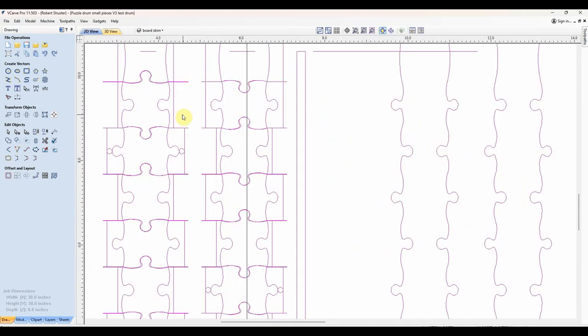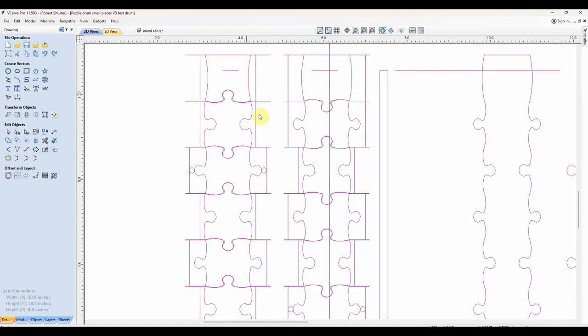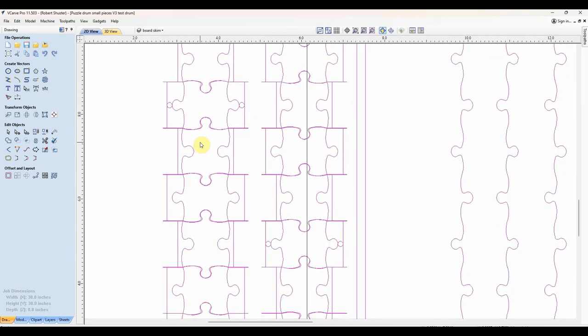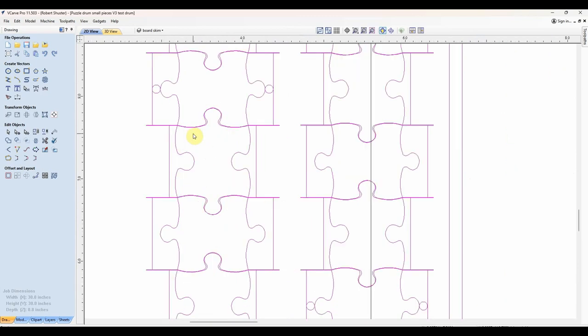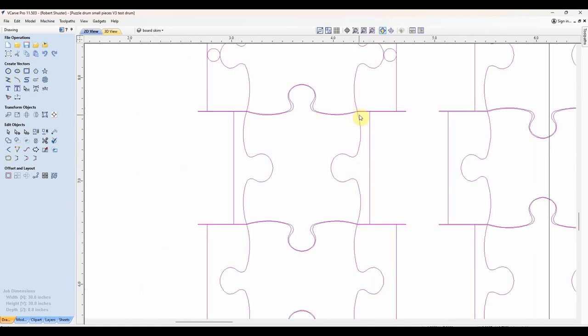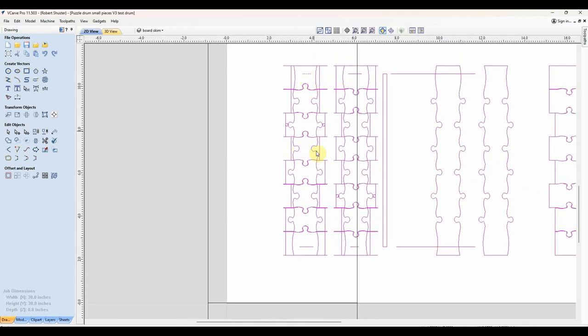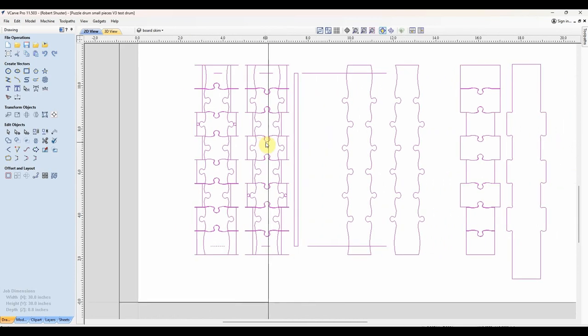Here's kind of the end result, what you'll see. Even though this is all one big strip glued together with different puzzle pieces, I'll cut the sides out with one long toolpath there. It looked like eight pieces, eight separate pieces. They're 1.1 inches wide and tall — it's hard to explain, but from point to point is 1.1 because it's not a very straight edge. So it's an eight-inch drum on the end, actually marked there as eight and eight. My pieces will be closer to nine and I'll cut off the edges to get a nice smooth finish. So that's the puzzle pieces, the whole process.